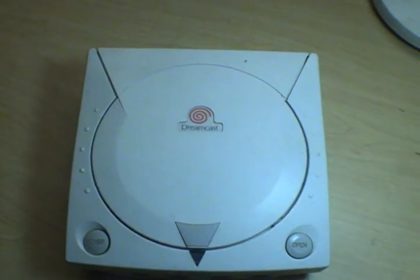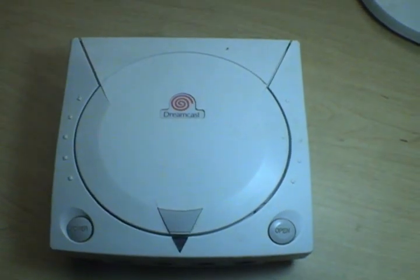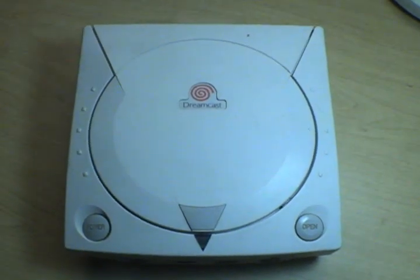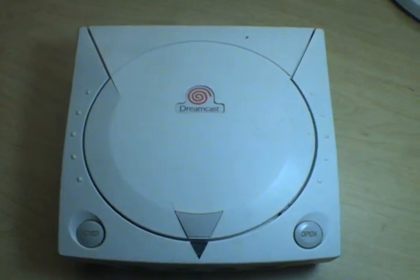Well anyway, you don't want to plug any multimeter into any capacitor that's got more than about 2000 UF, and you want to be real careful about doing it at high voltages, anything above 50 or 75 volts, and anything that's got more than 1000 UF. In most electronics, not a big deal.